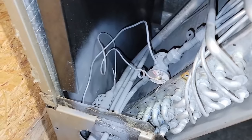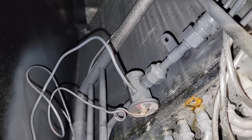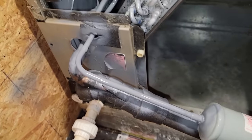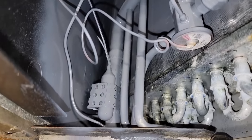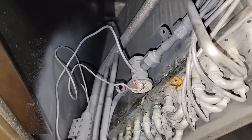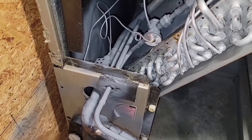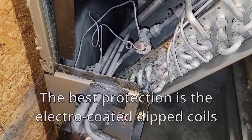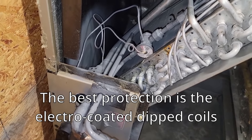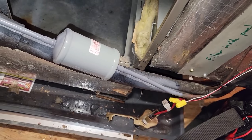Went ahead and painted the copper gray just to give it some extra protection. Had to make my own 90-degree bends, then sprayed the bulb and fittings. That sulfur crap just tends to eat anything — the paint will slow it down some, but it's not going to stop it. I've tried cold galvanized sprays and that carrier blue stuff that peels off too — all of it just tends to fall off. While that's drying, I'm going to go pull vacuum on this thing and get it running again.